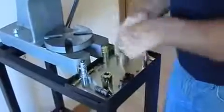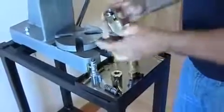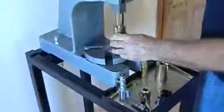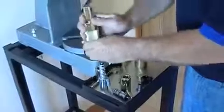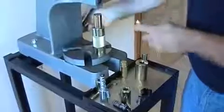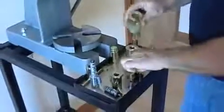At this point we change from spacer 1A to 1B — this is to straighten the canister. Insert the straightening tool down into the fixture. Turn it round, press down again to ensure it's perfectly true before we move on, then change back to spacer 1A.